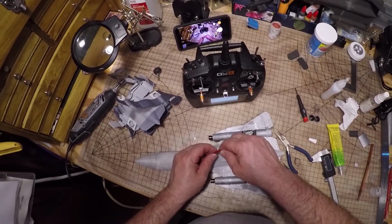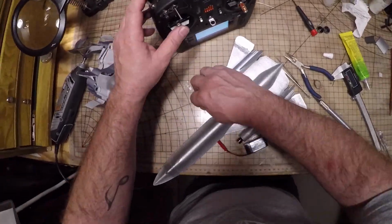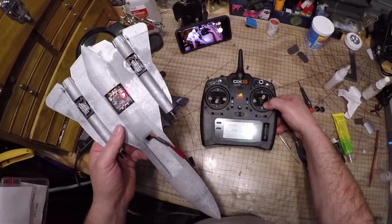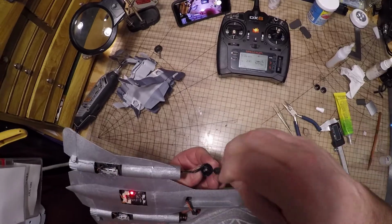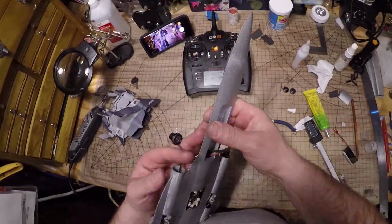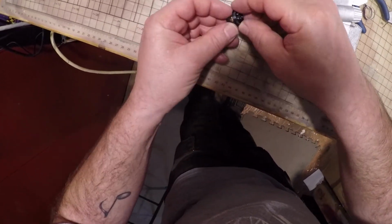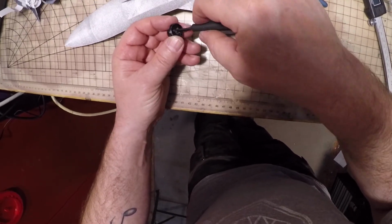Make sure they work. So over here, I went to test the motors, and one motor wasn't spinning. What I didn't do was clean a little fragment of PLA off the motor mount print. It was that little nipple that gets left over at the end of the print. So I had to take the motor off, trim it with a razor knife, put it back together, and then everything was fine again. So other than that, you don't have to do anything to the motor mounts. They should work fine.